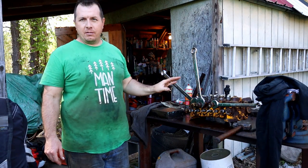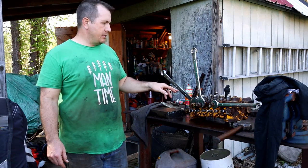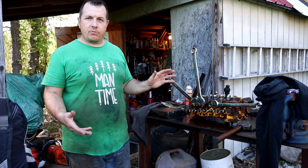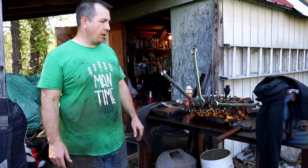So this is the valve body for the backhoe. All the hydraulics are run off of this system. And it's a modular system, so each of these different valve bodies is separate in this Ford 555. I guess the 550 had a single one, and that would have been, well, I mean, it's probably hard either way.